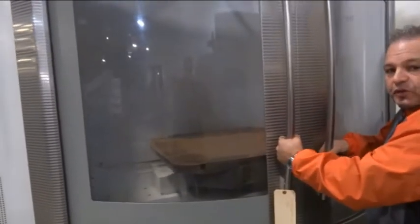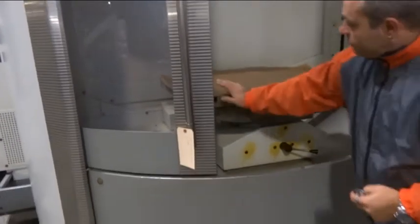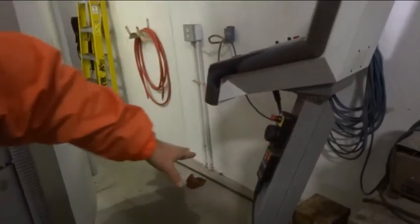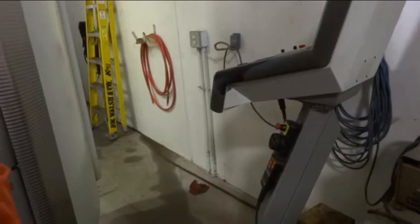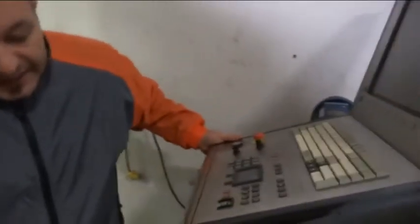So then we close all the doors, we put something around so that the doors don't open during vibration. Tables will all be left on it, it's all cosmoline, and it's closed so it doesn't shake around during transportation. The handle we unplug from the machine, we put that in bubble wrap inside the electrical cabinet, and then we bubble wrap the control and put the key from the control, actually this key, with a wire tie inside the electrical cabinet too, okay guys? And we bubble wrap that and shrink wrap that, and when it's on the truck, we shrink it in so everything is tight and nice.